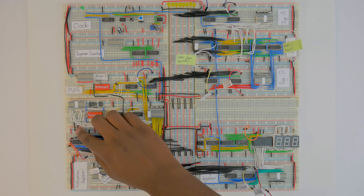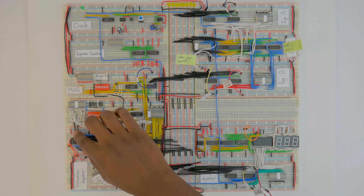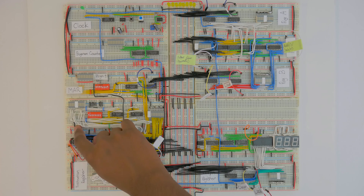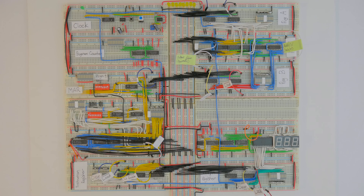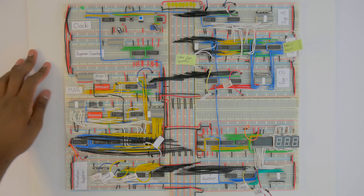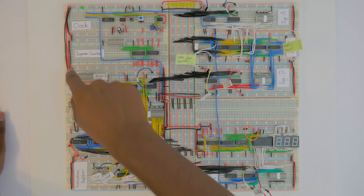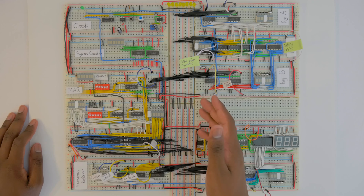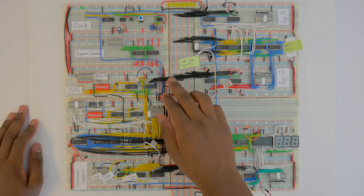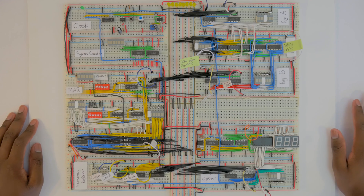Another step to avoid power issues is plugging into the same spot every time. I created a little outline — it doesn't carry any voltage, it just loops around — but it makes sure I plug the charger into the same spot every time. When connecting power rails in parallel you shouldn't just daisy chain them together, because resistance builds up and voltage slowly drops. I daisy chain about two lanes together and then run one back in parallel, because parallel connections have the least resistance.